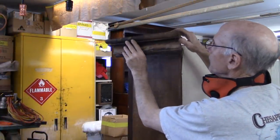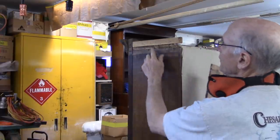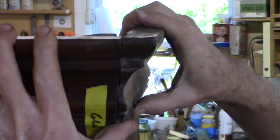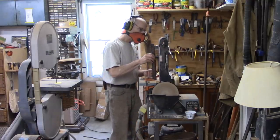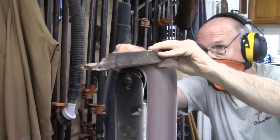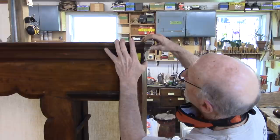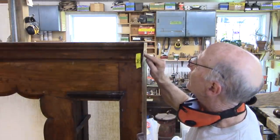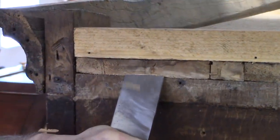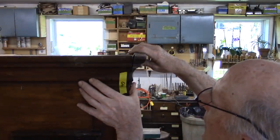Just what I thought — there are two things happening here. The back of this is not completely flat; it's cut a little bit this way. And then this end grain sticks out a little bit past here, so you've got quite a rocking motion. I'm going to try to take a little bit more off the back of this, and then I may just have to add some wedges along the top to give it some support. Taking that off the back of this molding has really helped a lot. It's rocking on this end grain right here, so I've got to really take some away right here.